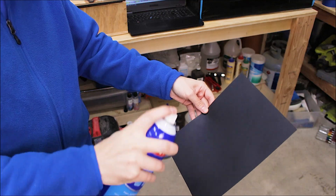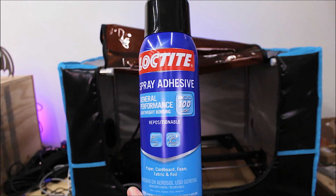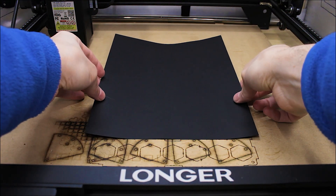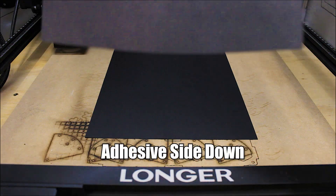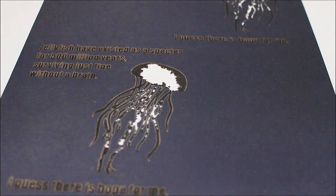To make sure we have the best contact between the acrylic sign and the cardstock, we're going to use some spray adhesive — but not just any spray adhesive. You want to use a light bonding repositionable spray adhesive so that you can peel the cardstock back off. I'm using a piece of MDF because I know it's perfectly flat, so I can put the cardstock on it with the adhesive and it will hold down and stay flat. I'm also using two pieces of cardstock because in testing the laser was cutting through the first piece.